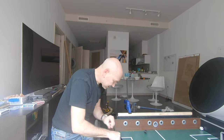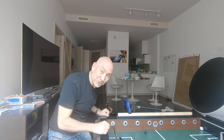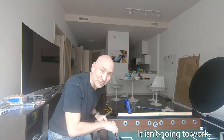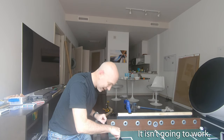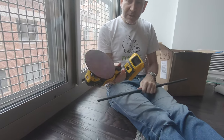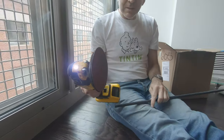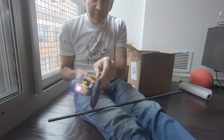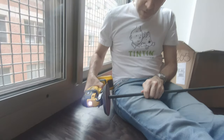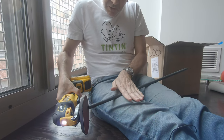Here's a test of my telescoping rod system — it's going to work! After ordering many different rods from McMaster-Carr and sending them back, I have a system that works. I want to make the end more of a bullet shape so it slides easily into the rod. I've got 60-grit Velcro sandpaper on my tool and I can just use any angle I like to shape it.